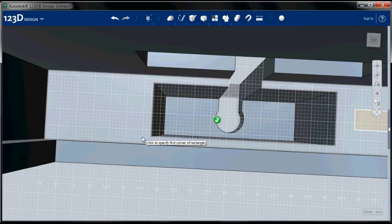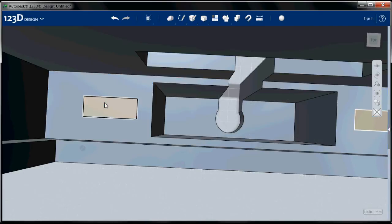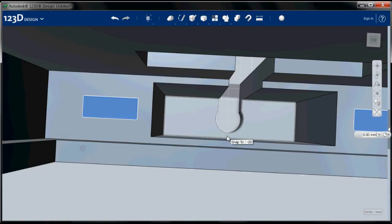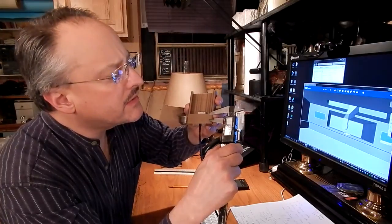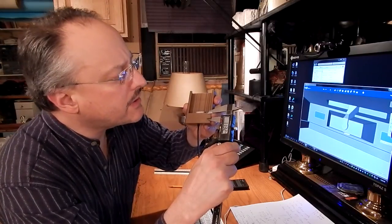Same thing again. This is my sketch plane. I'm going to go in, and like I said, this is rough. And I'm going to go 2 millimeters over and 2.5 millimeters up, and I'm going to create an 8 millimeter by 3 millimeter rectangle there. Now I'm going to my construct tool, I'm going to select both of these, and I want them to go down approximately, I'm going to say to about there, to the bottom. So I'm going to go down about 12 millimeters.